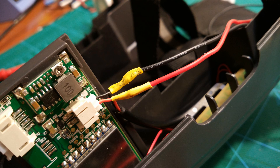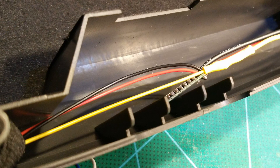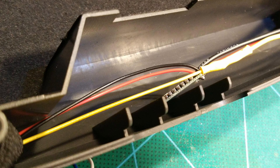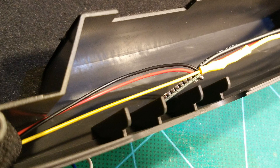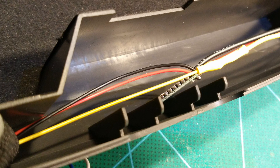After figuring this out, all we need is to get some power to the DVR module. I took the power directly from the cables going to the receiver and routed these cables to the other side of the goggles, where I also put the video cable already. You can see the red and black cable providing the power and the yellow cable carrying the video signal.